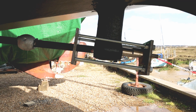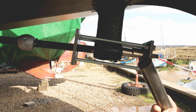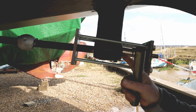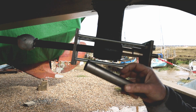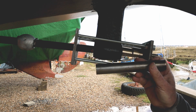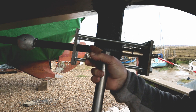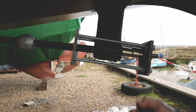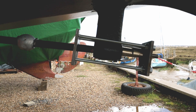The other item in the toolkit is this, which is just a bit bigger than the shaft and reaches all the way through. The reason for that was that the shaft inside had a lot of concretion because the boat had been left in the water for a long time. This was used to very gently run up and down to remove the concretion — by running gentle acid through and rinsing thoroughly, we removed all of the concretions on the shaft within that area.